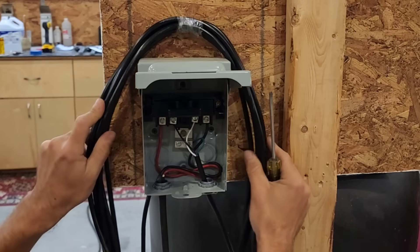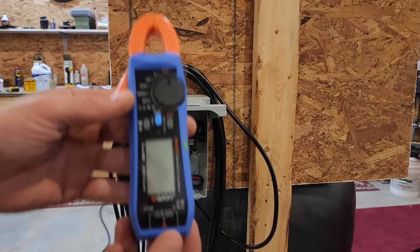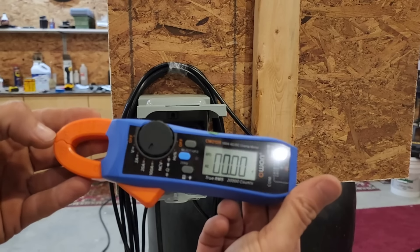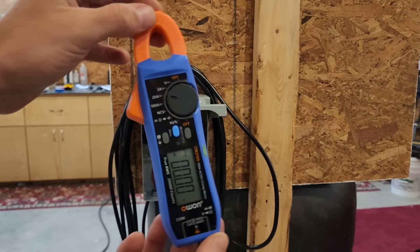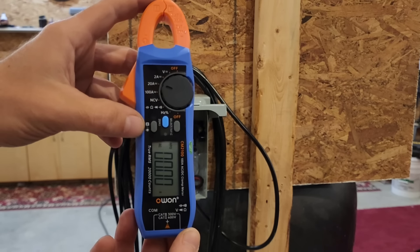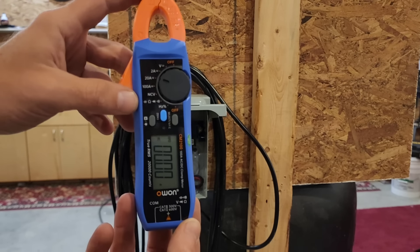This right here is the cable that comes with the pump, so we're going to leave that as part of the line and clip an amp meter right on here. I just received this in the mail today — ordered it off Amazon. This is the most important device when checking a well pump to determine if it's good or bad. If you know what type of well pump you have, you can revert to the chart for that pump and it'll tell you the typical running amp draw. If the amp draw is more than the maximum reading, you'll know your pump is starting to fail.